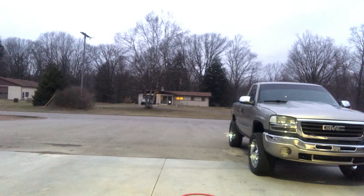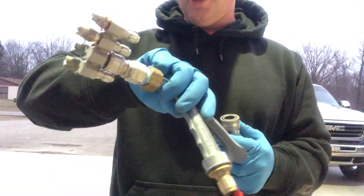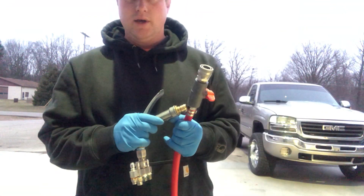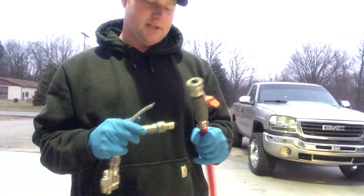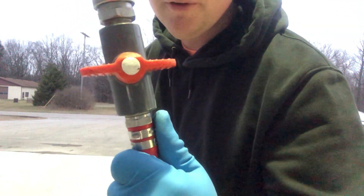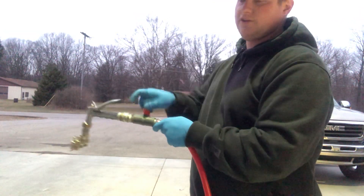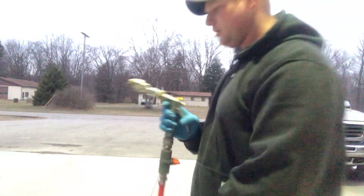I've got a bunch of different guns here. This is a Gilmour gun, and I run an oversized barb — it's actually a sanitary food-grade stainless steel fitting. I was the first guy to do the ball valve setup with a soft wash system. This ball valve is about four years old — it's a George Fisher compact half-inch ball valve with a Viton seal. It's threaded on both sides and doesn't leak.